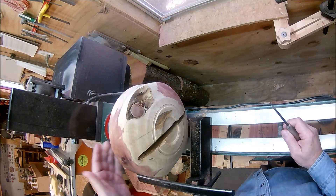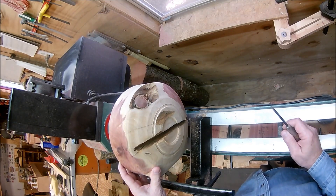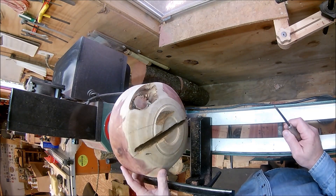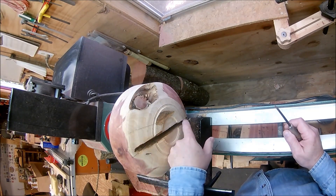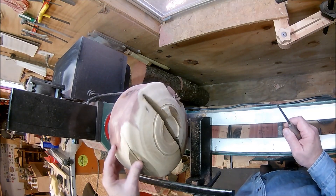I think I may just go ahead and keep going — try to get a recess down in here good enough to hold, and then make sure when I'm hollowing out the inside that I'm using the tailstock and being gentle with it. I want to see if I can get a bowl made out of this without having to put a bunch of resin in it — just leave the natural look. We're going to try that today and see what happens.